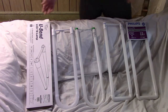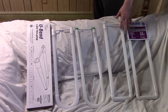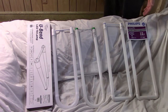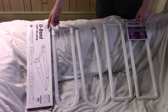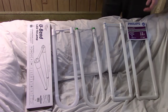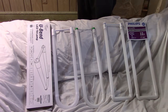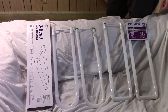So how much do these LEDs use? This one says 15 watts and this says 13 watts. Is one really more efficient than the other? It kind of depends on whether they're multiplying by the power factor or calculating it in. If you took 0.88 times 15, you get about 13 — so maybe these are using the same amount. The best guess is to assume LEDs take about half the power of fluorescent and do your calculations on that.